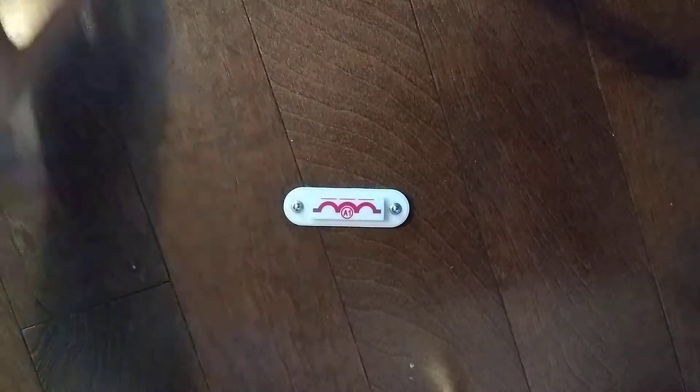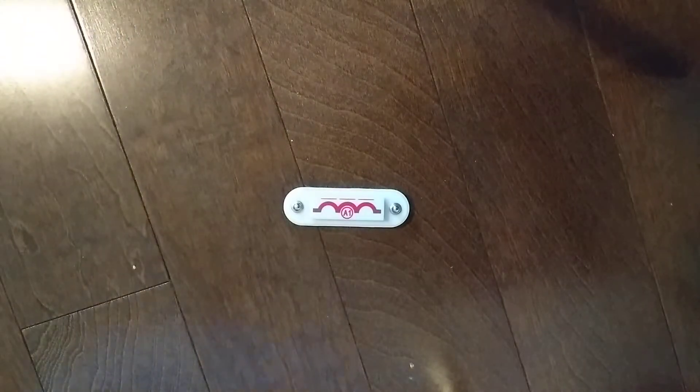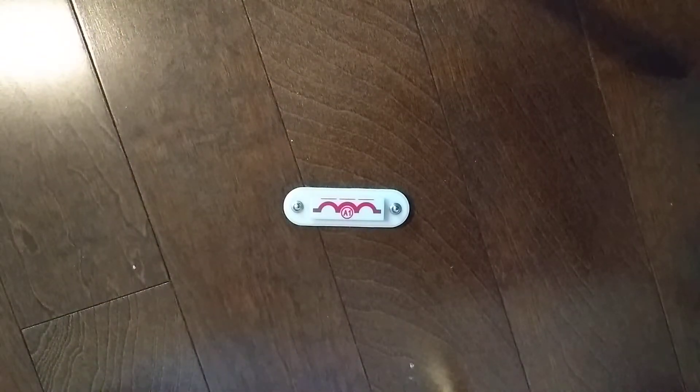This is the A1 antenna coil. This antenna coil, A1, contains a coil of wire wrapped around an iron bar. Although it has magnetic effects similar to those in a motor, those effects are tiny and may be ignored except at high frequencies, like an AM radio. Its magnetic properties allow it to concentrate radio signals for reception. At lower frequencies, the antenna acts like an ordinary wire.